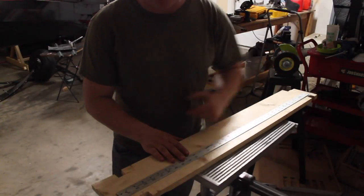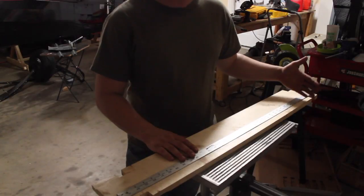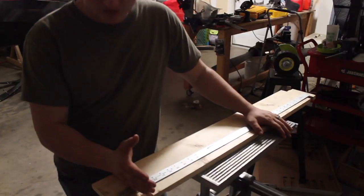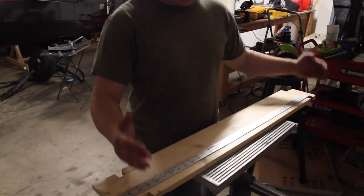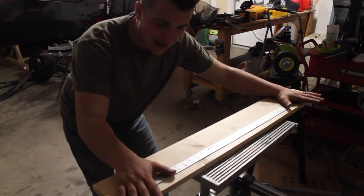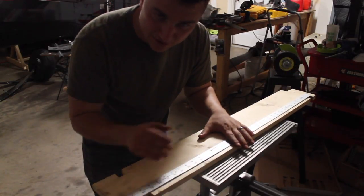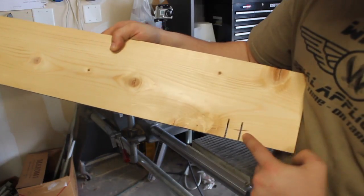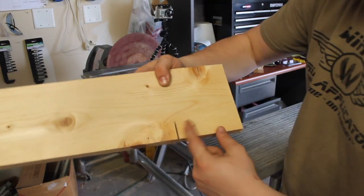I needed the very forward edge of the first cross member — station zero on the plans. 34 inches back from that is where the center of the tube cluster should be. Those are the two points I kept intact to build everything in between. It's a one-inch cross member in the front and a seven-eighth cross member at station 34. I measured out zero and 34, then put it on the chop saw with cuts to the inside of the mark.